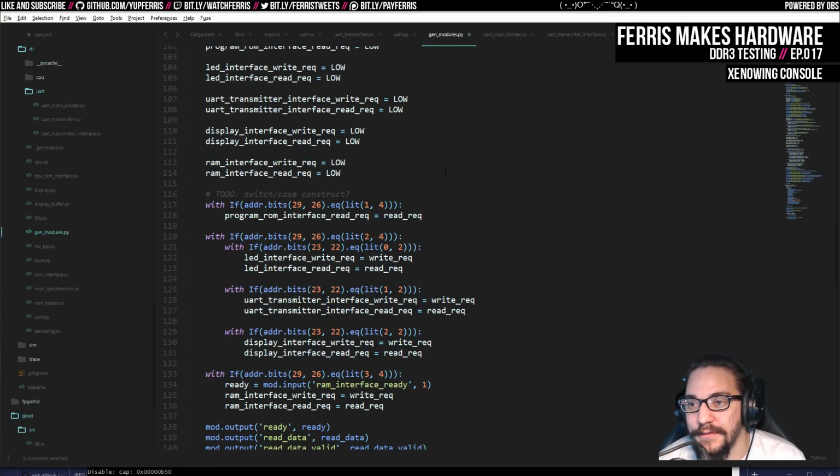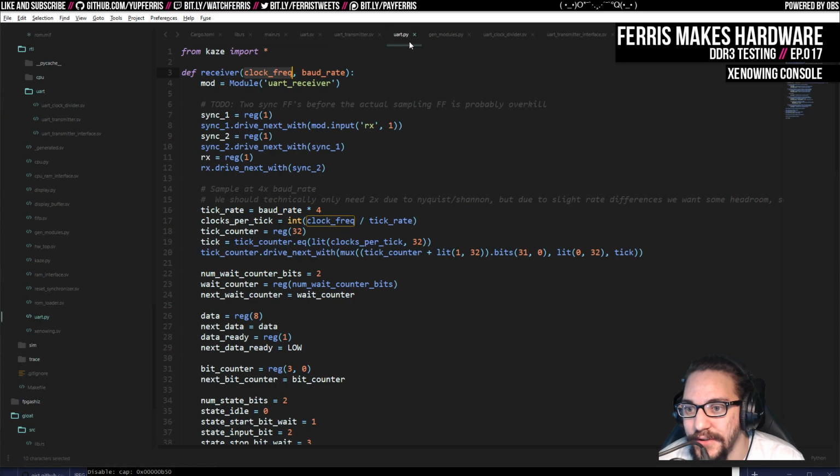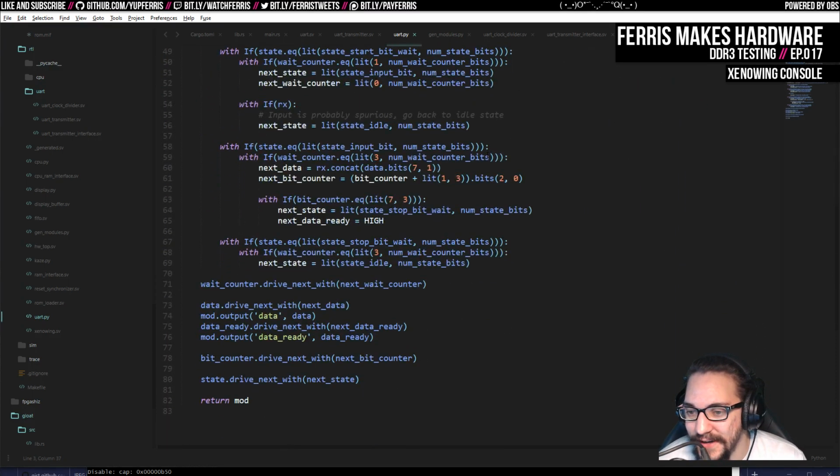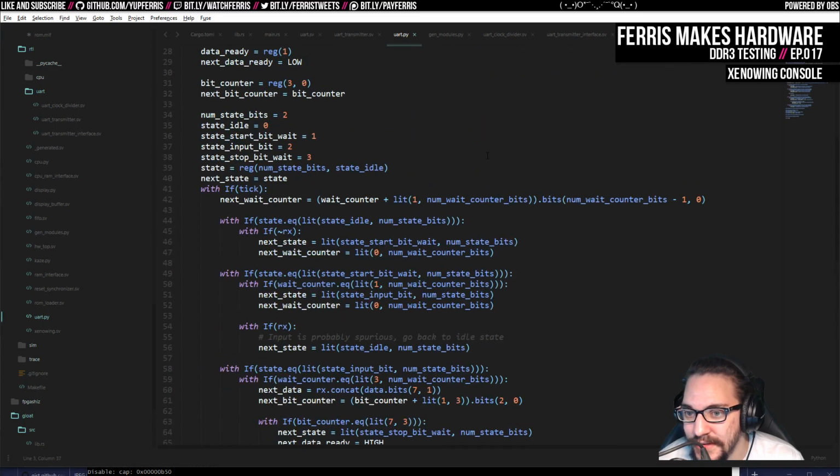But yeah, I do think it's going to be really funny if we end up with a vector unit for vertex processing that ends up being more efficient than the pixel pipeline. But that probably won't be the case, actually, when I think about it, because the pixel pipeline is going to be really optimized for what it's doing. But the vector unit is going to process more than 1 pixel at a time. So if the vector unit has 4 element vectors, and it's slightly faster than 4 times as slow as the pixel unit, then it can keep up, I guess. I don't know. Will be fun to play with.